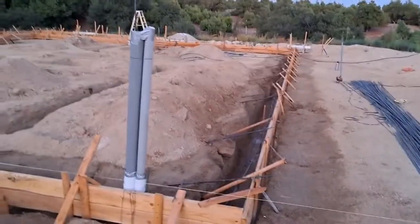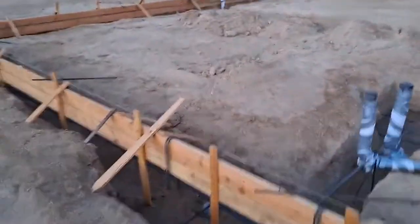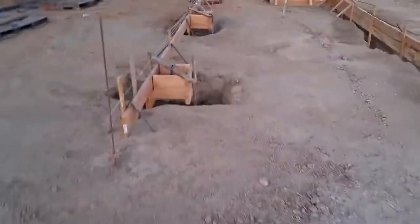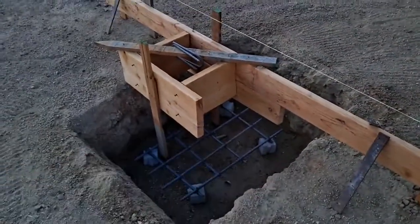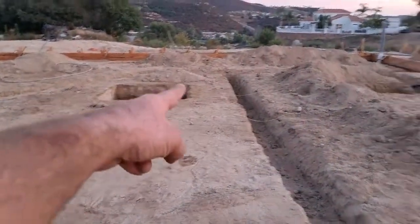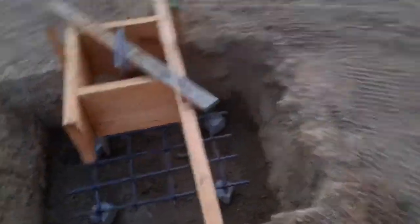The last big thing I called for inspection on was the footings and forms. That's actually taken a lot more time to get ready. I found out they're going to be really picky on a few things. Over at the pier footings I need to make sure 100% there's going to be three inches from every rebar to the dirt. I came through and did some trimming. Additionally, they want the footings totally clean - there were leaves, dirt, and rocks that had fallen in, especially in the big ones where I did the trenches for plumbing.